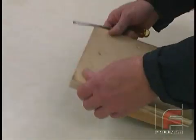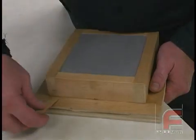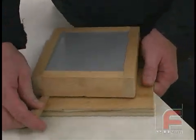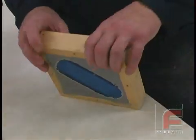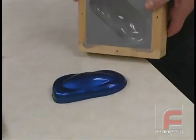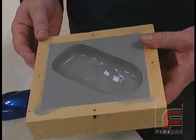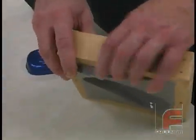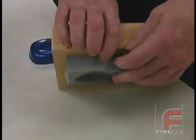The next day, our mold is ready. We remove the screws and then wedge the whole thing off with very little effort. Next, we pushed out our model from behind. Notice how accurately the silicone reproduces the surface of our model. Then we pushed out the mold itself and pulled off the edges with our fingers.